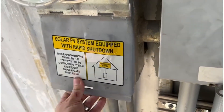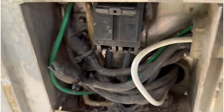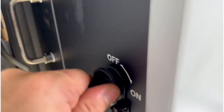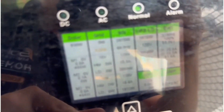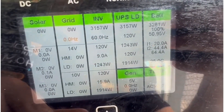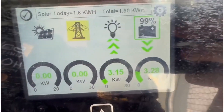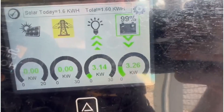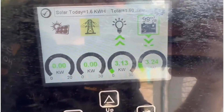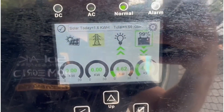We are going to do a test right now — try to run off-grid. Turn off the breaker right here. The paint mixing machines are running. Going to turn off the PV switch, just stay on batteries. This is what we are pulling right now: 3,157 watts, consuming straight from the battery. Both machines are running as of right now. We are waiting for the peak. Going to turn off the paint mixing machines.